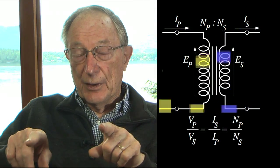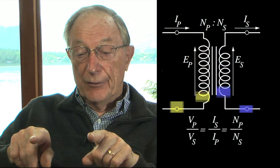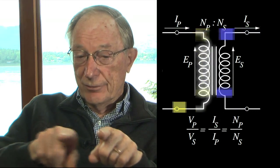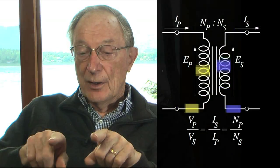Now if that's true and you get excited — you now have a voltage in a wire that's not touching this one — and you're greedy, you'll say: why don't I double it? I'll make it go around and come by again, and you will in fact double what you've found. If you're still greedier and keep making it many turns, you'll get a fairly high voltage across that second wire. And that's what a transformer is, improved on a great deal.